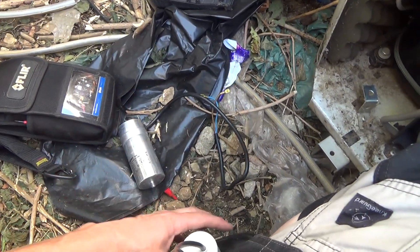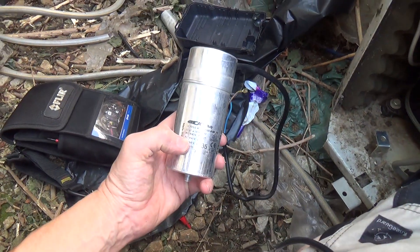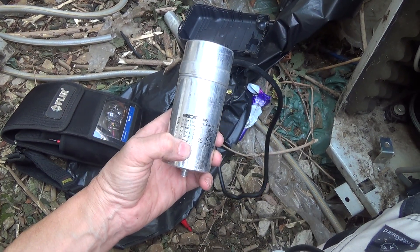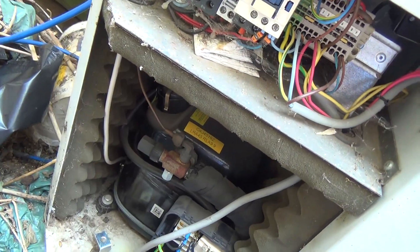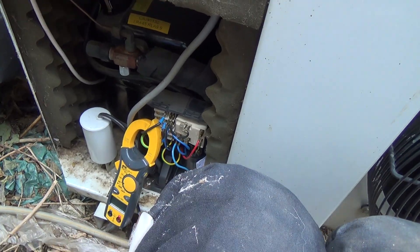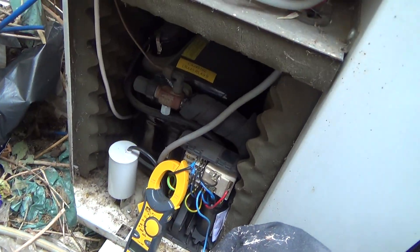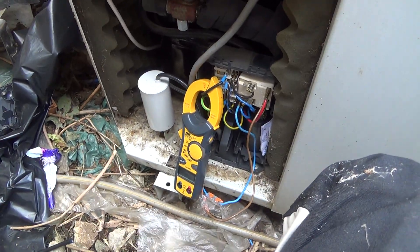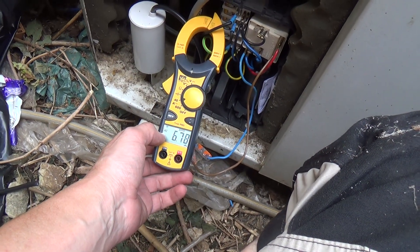Class A 400 volts - what's this one? Class A 420 volts, Class B 470 volts, Class B 450 volts. It might be the 2021 production date - so it's done four years. We put this compressor on a while ago. Let's get that fitted. Nine amps without the capacitor, down to 6.8 - quite a drop.